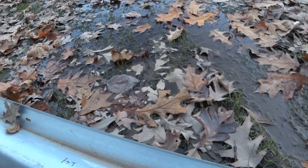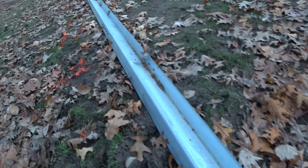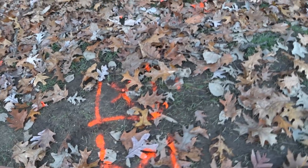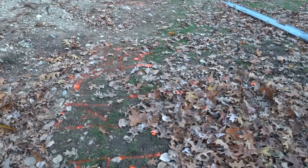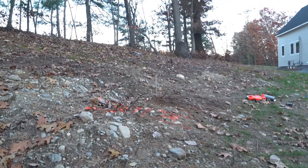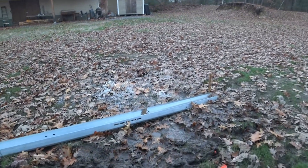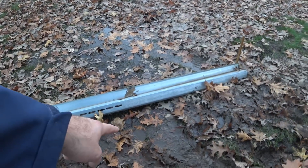I went ahead and marked the edges of the panel, and this is where the timber base is going to go — another panel, a one-inch gap between them, and so on — all the way down. Over on this side I went ahead and marked the X's where I need to place the timbers. Two of these should be no-dig; this one I'm going to have to dig out a little bit, and this one a little bit more. At the low spot where there's mud, I'm going to toss some gravel down with some landscaping fabric to bring that up. At least we have the orientation down and Elena has approved the location.